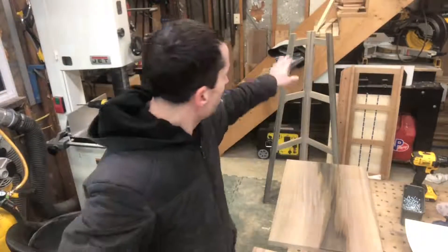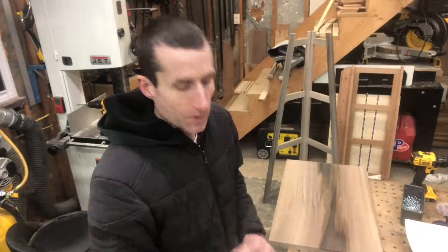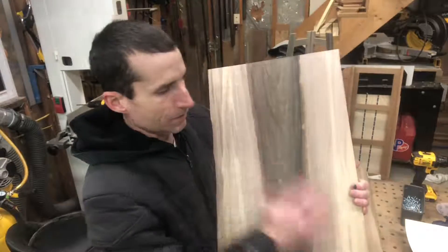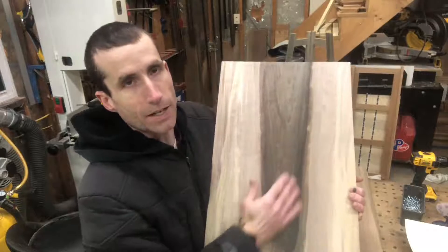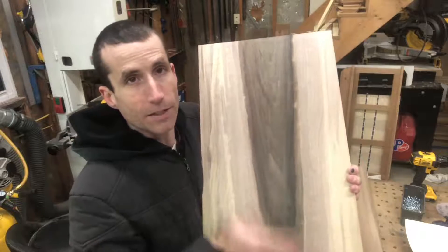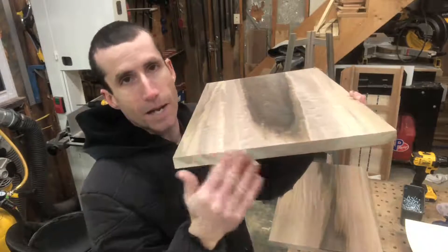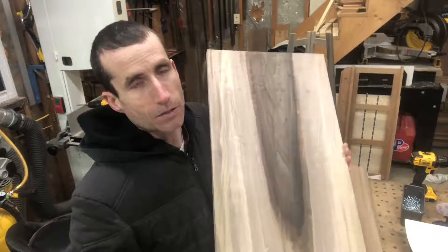Now I have the unit assembled and I'm working on the shelves. The first step is to find a board that's going to cover your main widths and get out of the two opposite corners. You might have to glue a couple pieces together. I did find some pretty wide flat boards. Normally if you laminate pieces together, flip the end grains — frown, smile, frown, smile — that's going to help keep the board flatter. I joined both edges, though it's not a parallel board.